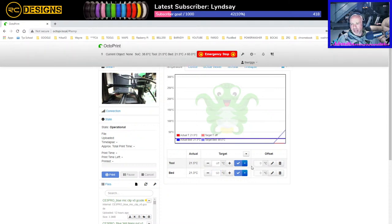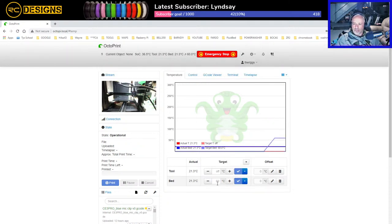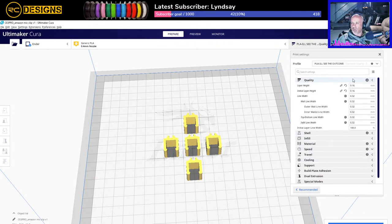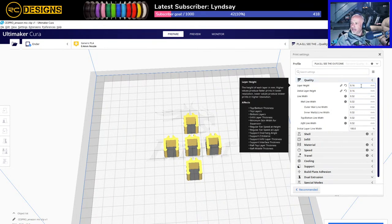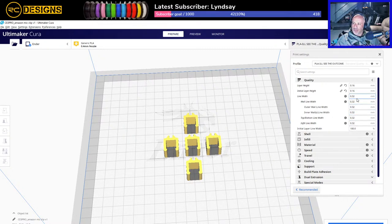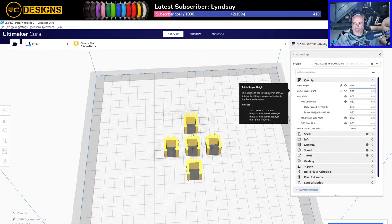I will get my bed going. I've kind of lagged behind on this one because I usually get it going as I'm doing my Cura. But let's pop this up at 60. Minimize this. Let's just go through these settings one more time. If you're following and you're not really sure how your settings are and you're trying to mimic this, I got these from Chep, the 0.32s. Chep on Filament Friday, big shout out to him. He showed you how to get rid of the elephant's foot or mushroom on the bottom, and this was one of the ways to do that. So that's the reason why I'm at 0.32s.